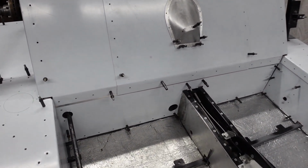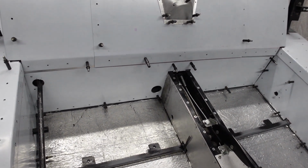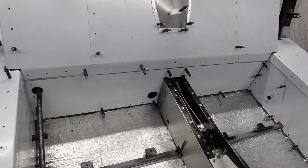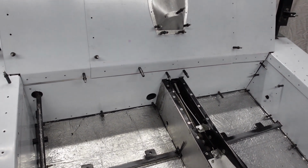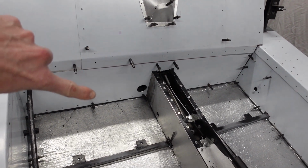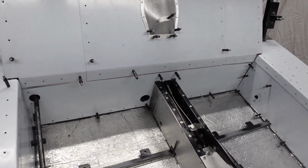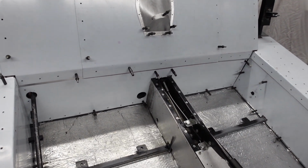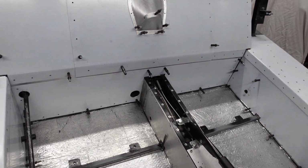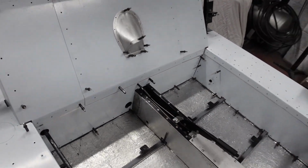I've also finally got fixed in place the lower bulkhead panel. Basically I had to do some remedial work to that because, in all honesty, I'd cocked up. I had drilled out the old rivets along this bottom edge with too large a drill bit. So I had to go along that edge, welding up the holes and then re-drilling them to the correct size. So that was really bloody annoying.